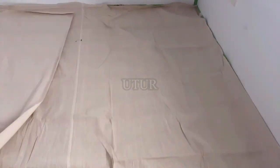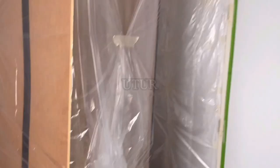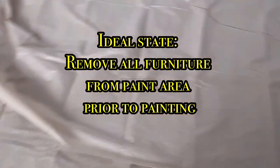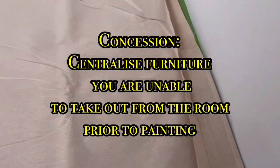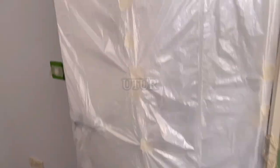Also make sure your radiator, furniture and door are covered up. You can spread general masking paper or brown paper around the corners of your room to catch all the paint that would be spilling down, just before the skirting board and carpet protector. You can use brown paper or a dust cloth sheet, whichever comes in handy. I have frog tape on the ceiling, on the skirting, on the door frame and the recess of the window.